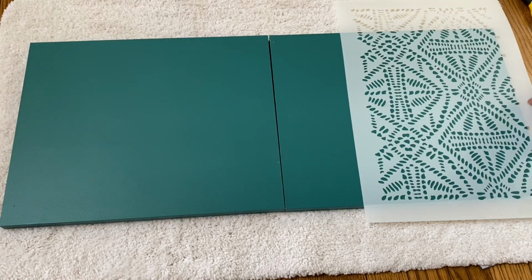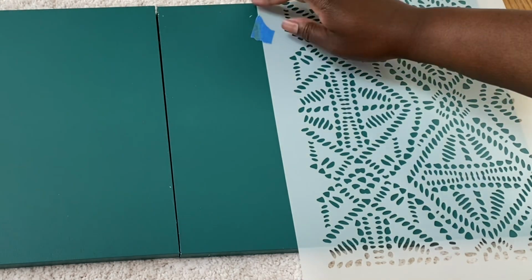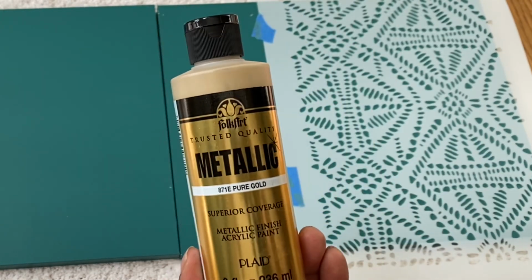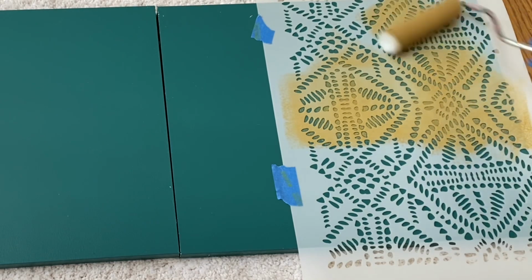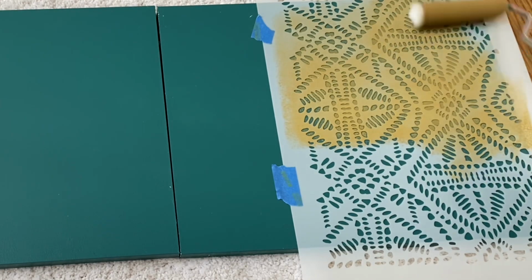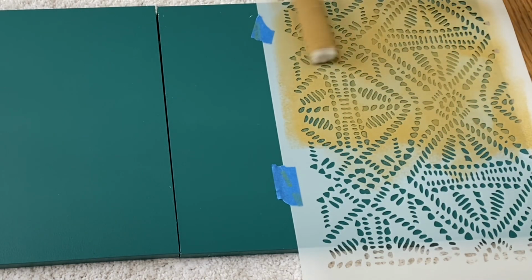Now, I got this beautiful stencil, and I will leave the link to it down in the description box below, but I really wanted to add just a little bit of shininess and glam to this beautiful teal color. So I just got some acrylic paint from Walmart, and I'm going to stencil on this pattern to the front of my cabinet. Now, you want to make sure that when you're doing a stencil, you are putting a very little bit of paint on your paint roller, and then you're just going to roll in all directions over and over until you get the desired effect that you want through your stencil.